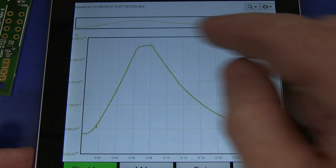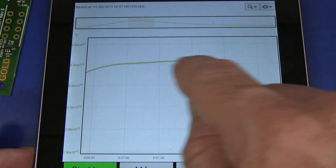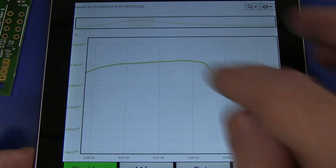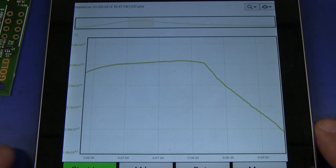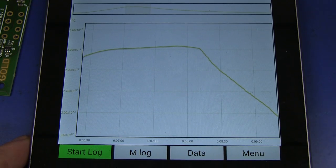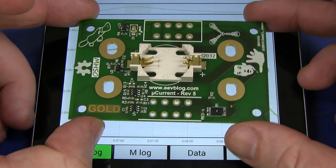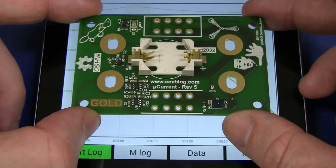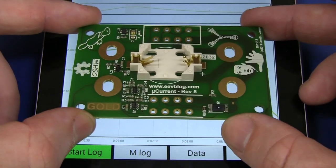And there's our thermal profile, and if we get in there we can actually see the top temperature just over 230 degrees C there. I'd like a 232 by the looks of it. And that precisely matches what I saw on my Agilent meter as well. That's the maximum value I got out of this thing. So I've got really good confidence that I'm not going over temperature with anything on this board. I'm really happy with that. And it really shouldn't matter how many of these boards I put inside there either, because it doesn't change the equation at all.